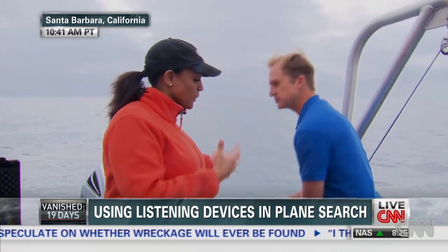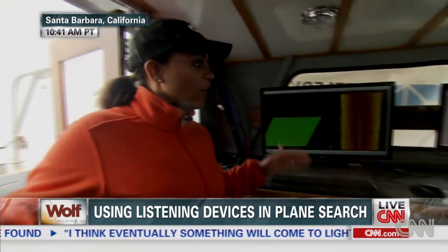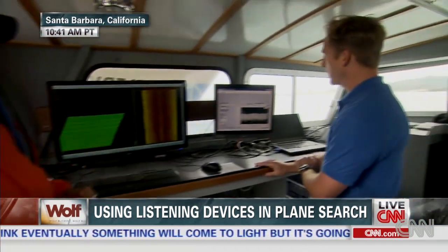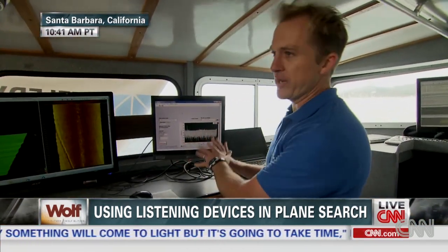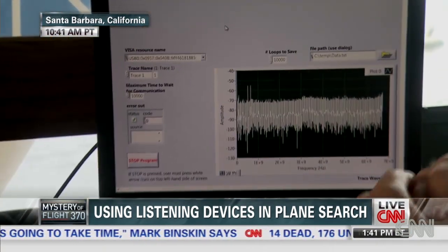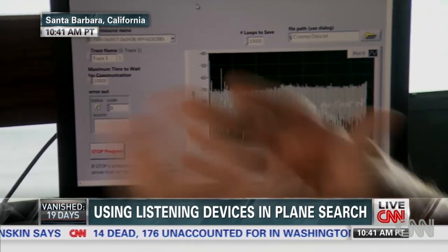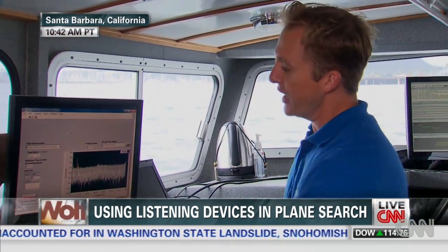Let's go see what this looks like with the technology once we go inside. We're going to go inside to take a look at how this works. So what we have on this screen here — this is just a visual readout of what the hydrophone is listening to right now. All we really see right now is random ocean noise. If there was the beacon out there, you'd see a strong spike at the 30 to 40 kilohertz range, which is the frequency that that beacon is emitting at. You'd see a strong spike coming in once a second.